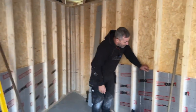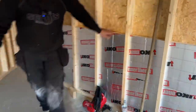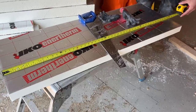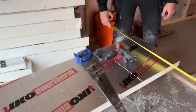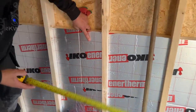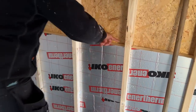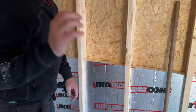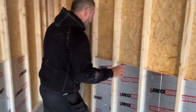We're using 50mm in the wall - it's a cavity back there, you can see that. They're 1200 by 450. We cut along it at 450, so there's your 450 there and another 450 there, which gives us 900. Then we'll drop a noggin on top - it's not quite half but it's absolutely fine. It saves a lot of cutting and a lot of time as well.